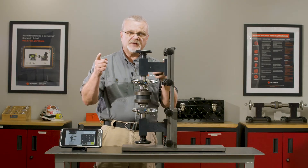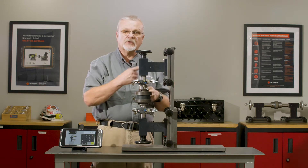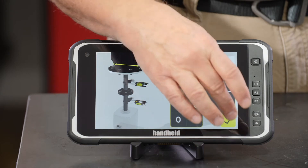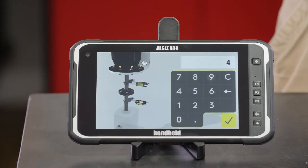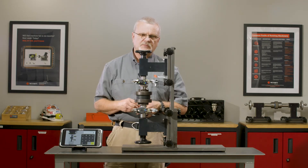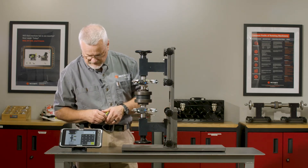The third measurement wants to know the diameter of our bolt circle. Let's say we've got an 18-inch bolt circle on top of this C-face flange, so I'll tell it 18 inches. Lastly it wants to know how many bolts are in the circle. Typically these are four, sometimes you'll see eight. Very large machines you may see 16 or 32, but we're just going to go with a four-bolt circle right now.